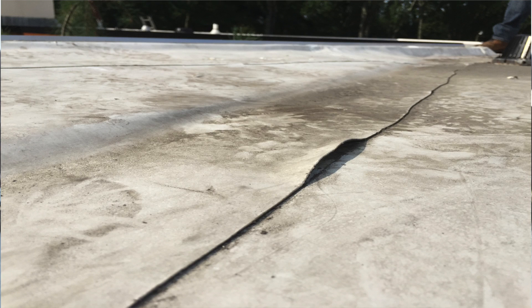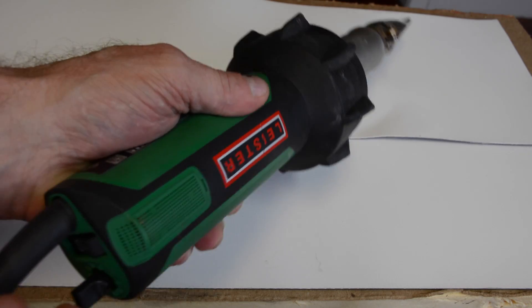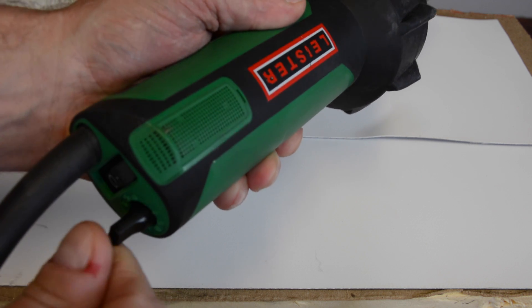Here are some of the disadvantages of TPO. First, the system is fairly new to the roofing industry — about 15 years — and has a long track record of revisions and improvements due to surface and seam failures. Also, TPO is known to shrink, and its rigidity causes stress on seams and flashing. A prolonged period of excessive heat exposure causes ultraviolet light degradation. Another con is that contractors must calibrate their welding machines very carefully. Improperly welded seams may come loose during the first freeze and thaw cycle and lead to water infiltration. Lastly, the manufacturer's warranty is only 15 to 20 years.